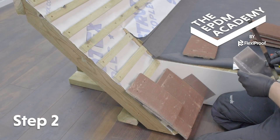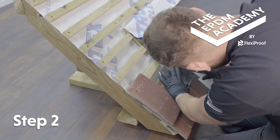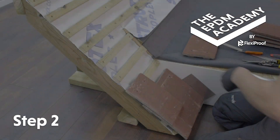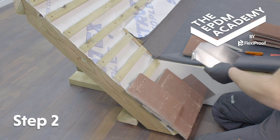Tile the roof starting from the bottom. Position zinc soakers against the abutting fascia. Use a metal ruler and a scribe to mark the cutoff point in line with the roof deck, then use metal shears to cut the zinc soaker to size along the marked line.